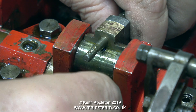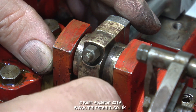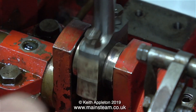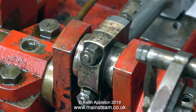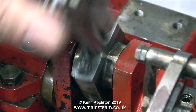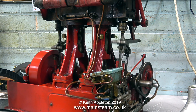If you look where the stud comes through the brass you will see there is no tolerance - it's a tight fit, and it's also a tight fit on the other side; engineering at its best really. I'm fitting the nuts that hold the lower brass in place. It's very important not to over-tighten these studs - this isn't a car engine, this is a soft piece of gunmetal. Over-tightening will make the gunmetal distort and the last thing I want is a tight bearing on this shaft. This bearing will need running in and I'll re-adjust the tightness of the studs once I've run the engine for a while. As it turns out they're feeling okay - I've fitted the lock nuts. I'm going to start the running-in process even before reassembling the rest of the engine, just by moving the big end bearing back and forth on the crank pin. I think I can say that the big end repair is a success.